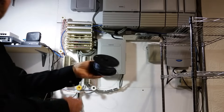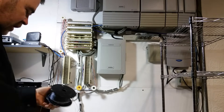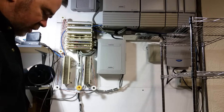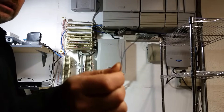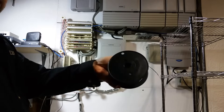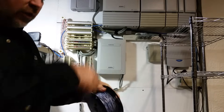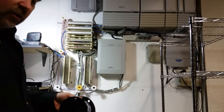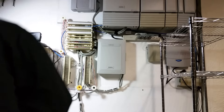The way we do that is with something called jumper wire. Most modern PBXs just need what's known as a single pair jumper wire. It's just your copper two-wire, 22 or 24 gauge wire, and it comes on a big spool like this. What makes it easy when you're doing a bunch of these is rather than twisting off what you need in advance, take the spool and set it on the floor in a cardboard box or a trash can with no bag in it, and just pull from it and let it pull easily.